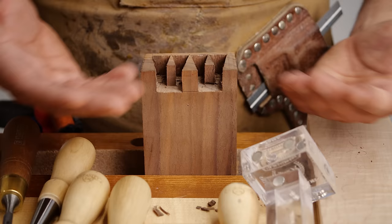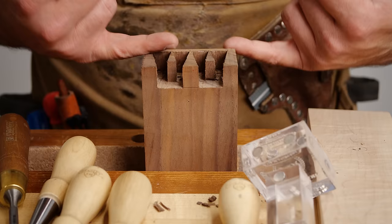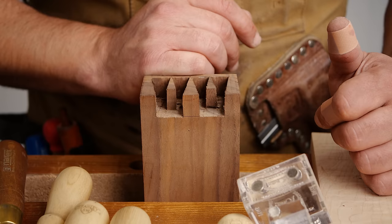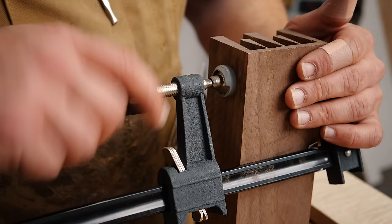We've got all this cleaned up and we're ready to glue up and see what it looks like. One thing I learned: those back corners are really hard to get into, so the drill press was really helpful — I'd definitely do it that way next time. When trying to get into corners, use all the tools available to you, whether it's a skew chisel or a really small chisel. Work your way into the corners from the side, to the back, to the side of the back — don't try to get it all at once or you'll get a big divot. Also put a clamp around your piece; these walls can get really thin and it helps prevent splitting.